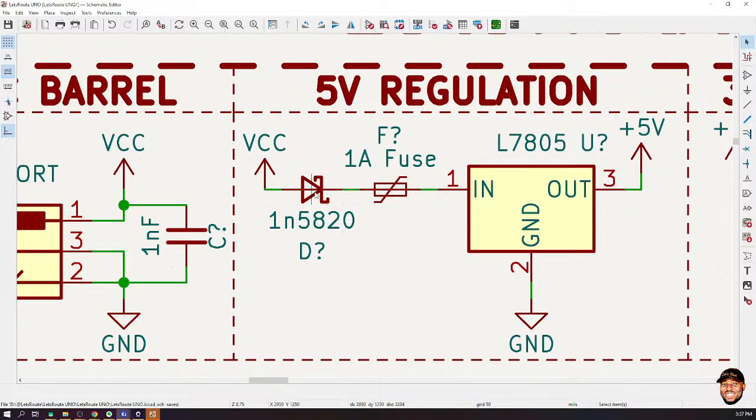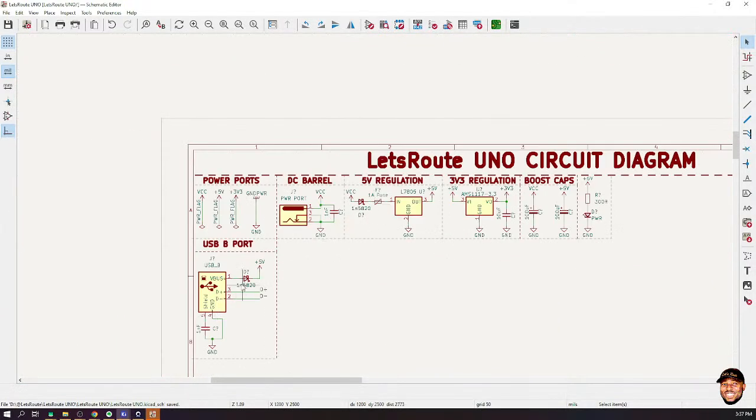Now, if you look at this Schottky diode, it can actually deal with 3 amps. It also has a small forward voltage drop, which is actually something I'm still counting on. Now, the voltage drop, looking at what we are doing, wouldn't have been an issue, except for the amperage, is that okay? So here, this is not considered because of any high frequency stuff. It's just because of the amperage, because this guy can handle about 3 amps. So that means drawing 1 amp through it wouldn't even cause it to heat up and all that kind of thing.